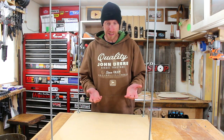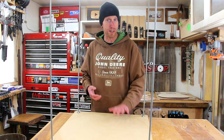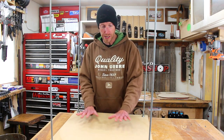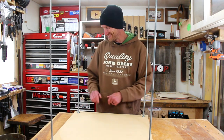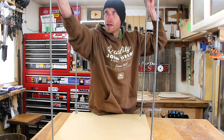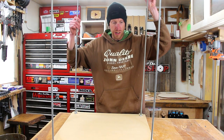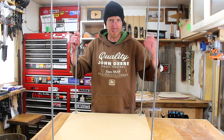With the basic Go Bar deck assembled, I'm going to take it back apart. I decided I want to apply a couple coats of lacquer to the MDF just to kind of seal it up and protect it — maybe it'll help prevent chip-out as I'm removing the adhesive-backed sandpaper in the future. After using this a little bit, I may decide to put some little pieces of conduit or something on here just to act as a more secure post. We'll see how it works out, though — I think this is going to be okay for now.